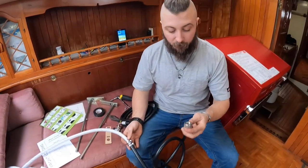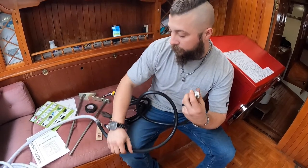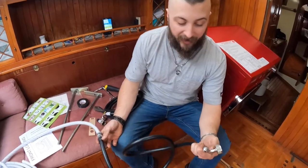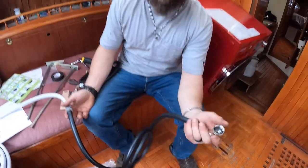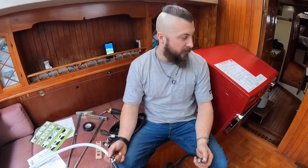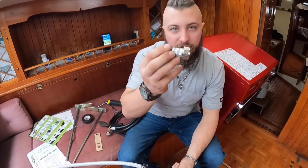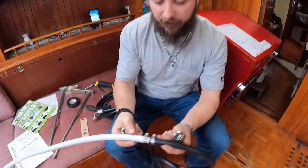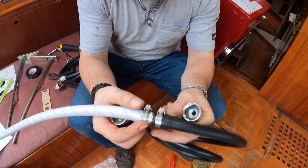So just like any washer dryer, you're going to have a hot and cold water hose, and this one came with both of them, and one had a 90 in it, and they both had these hose fitting ends. One goes to your washer dryer, one generally goes to your house valve, which we don't have here, because this is actually an RV washer dryer. Instead of trying to find a threaded fitting to barb, because it would just be redundant, I ended up cutting it off and just did a barb to barb. I just did a brass half inch barb to barb.